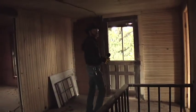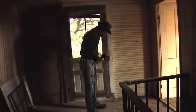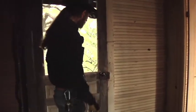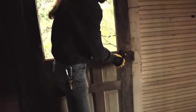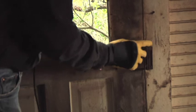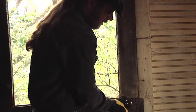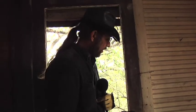As you come up, you have the grand area again - the central hallway. The central hallway leads out to what would have been a big balcony over here, and you would come out here in the evenings. All the knobs as you go through are an early porcelain knob known as a mineral knob - they're on lock boxes. Surface mount has a little lock on it, so you just push it back or forward to lock, or you can lock it with a key. The knobs themselves are made out of clay with a porcelain coating, and then molten lead is put in the back and they sink the shank into it. A very simple primitive knob all through the house.